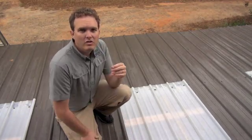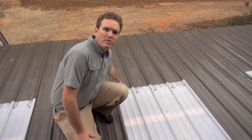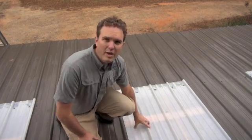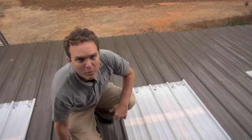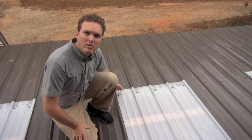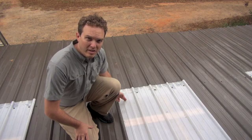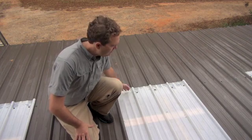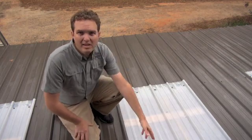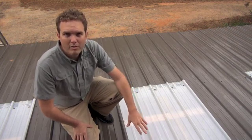You're going to use the two-piece metal techniques like described in other sections, where you do your flashing. To put this panel in, we installed the lower metal panel first, brought the skylight panel in, and then there's another panel that lays on top of it. A couple of important points: you want to make sure that your overlap over the next panel is pretty healthy — we want adequate overlap so that we can seal it and you're not going to get any water coming back up under it. Same thing at the top — the next metal panel above your skylight panel needs to come well on top of the skylight panel.